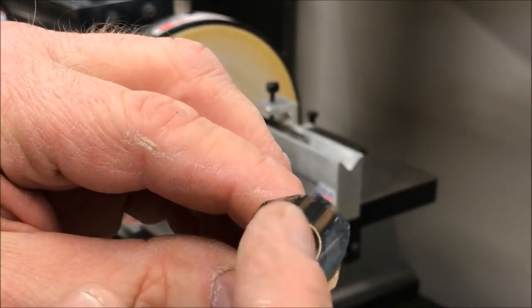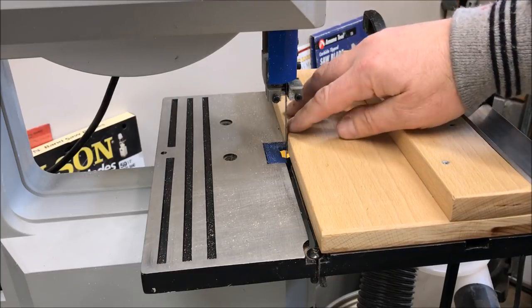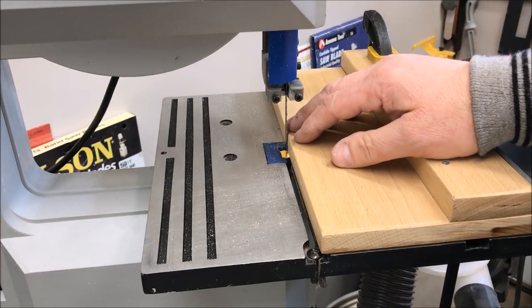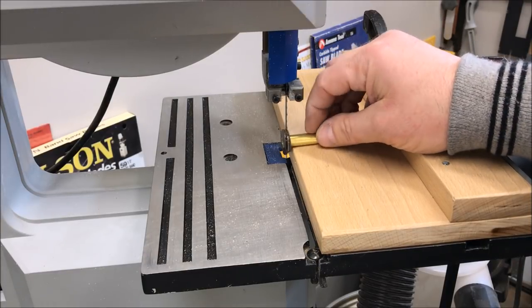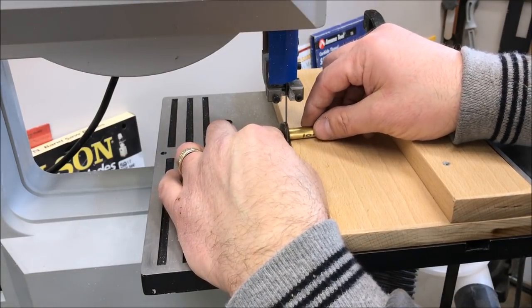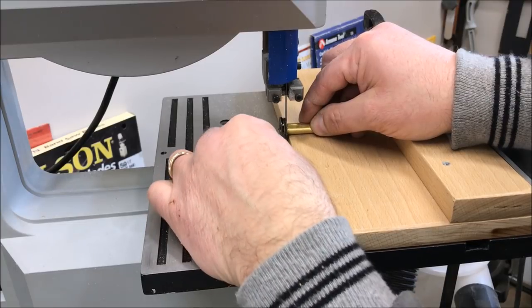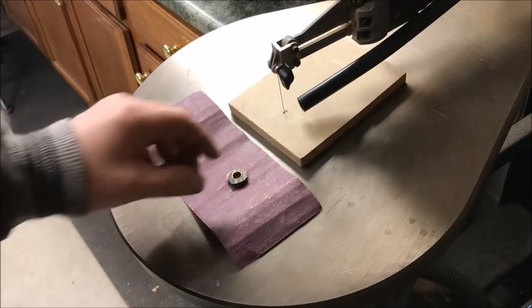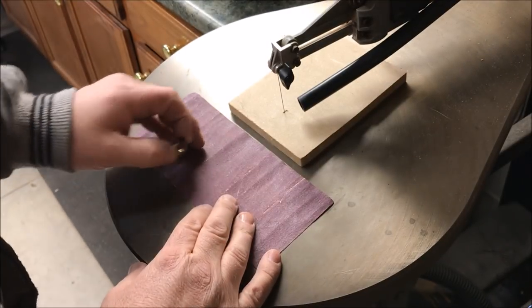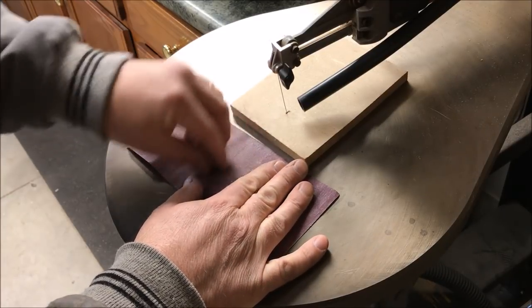Now we've got a very nice flat surface totally perpendicular with our tube. I'm over at the bandsaw and you're going to want to put a straight edge — just a piece of scrap board — right up next to your blade. I'm going to use the back side of my jig; it's not going to touch the blade, but you just need something high enough for your tube to rotate and not allow the veneers to hit the table. With the veneers separated from the tube you can see it's a little bit rough from the bandsaw. We're going to go to a solid flat surface and clean this side of the blank up.